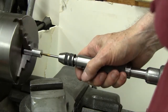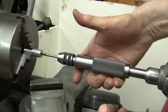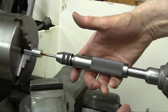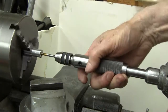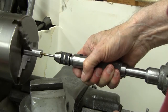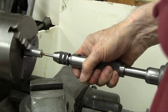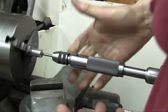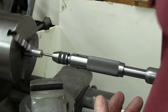I'm putting the tap in and we'll press it in — push with the sliding sleeve. We press the tap in again and it picks up the thread, pulls it in towards the headstock. You can see how lightly I have to hold the knurled sleeve. I can tighten my grip and it taps; release my grip and the tap turns with the workpiece. Soon the tap will bottom out and I will not be able to hold the knurled sleeve — it will take it right out of my hand. We're all done.